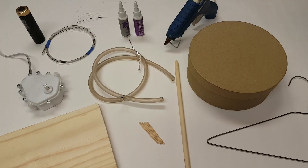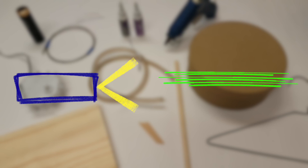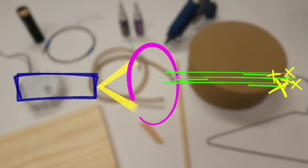Let's first take a quick look at exactly what it is we are going to be creating. We are going to take a light source and a bundle of fiber optic fibers. In between those two, we're going to put a rotating disc that will manipulate the light. That manipulated light will then be emitted at the opposite end of those optical fibers.